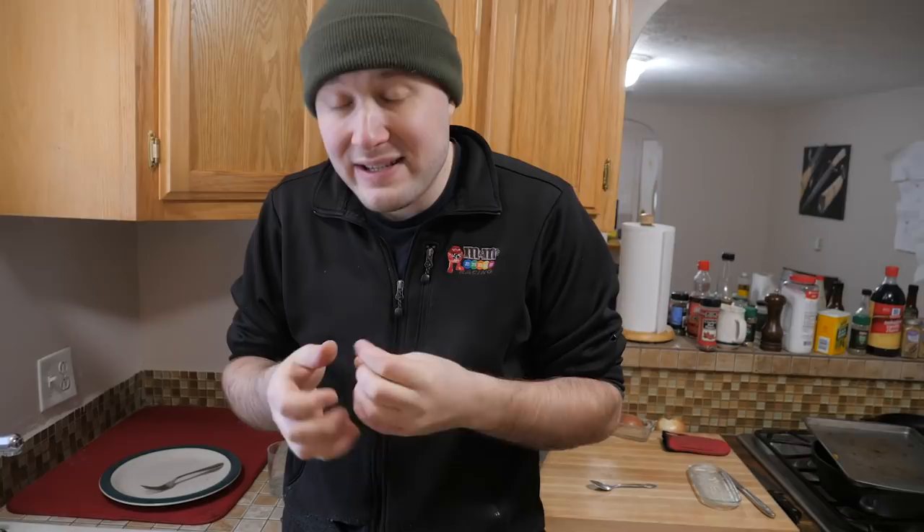When I get back we'll probably put a layer of Satanite refractory over the castable refractory, because that castable stuff is only rated for about 2200 degrees - same as the cable is actually rated for - so it's just using it for volume, since I'm kind of running out of Satanite too. Let it dry, then put a thin layer of Satanite over the top. Then I'll put out a little square as a temporary lid, and we should be able to start forge welding the second billet. The first one can actually be reprocessed now - it needs to be ground and four-wayed.